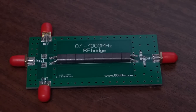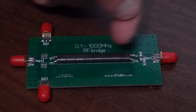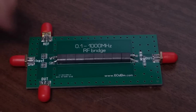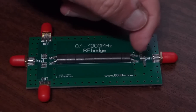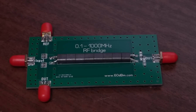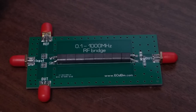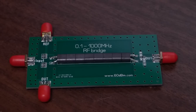Maybe even 100 ohms on the other side of that equation should work reasonably well — we'll have to investigate that. And then this is some kind of a broadband balun to take the balanced output from this RF bridge and convert it to single-ended for the output. We'll just see what we see on the Rigol spectrum analyzer with this thing as soon as I get the appropriate cables to hook it up.